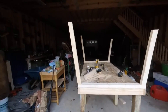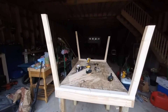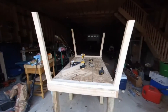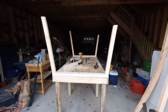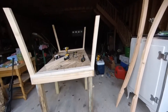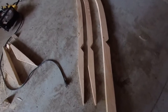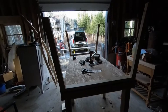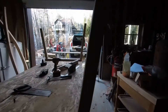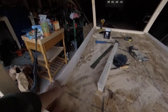I've got the front and the back walls done — they look pretty good. I'm going to put the top plates on and the bottom plate, and that will square everything up so I'll be able to lift it all up in one section and set it down onto the floor. I've got all my pieces notched out and cut how they're supposed to be. Top plate, bottom plate — square this all up, set it on the ground, and put the roof on.